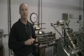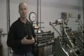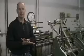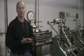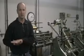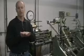We also use heat in conjunction with embossing and debossing. That's used so that basically we can iron the texture of the paper out to where we've got more contrast between the actual original level of the paper and the embossed or debossed level.